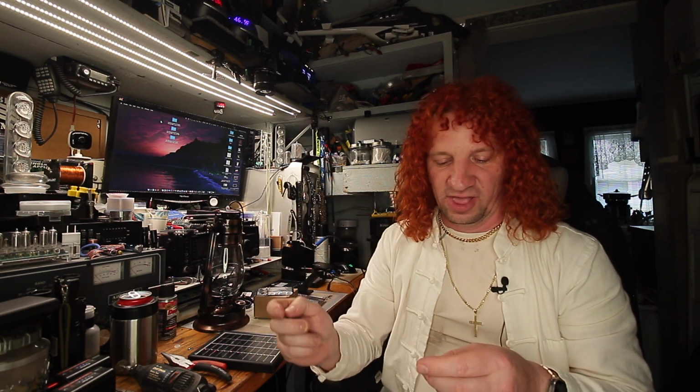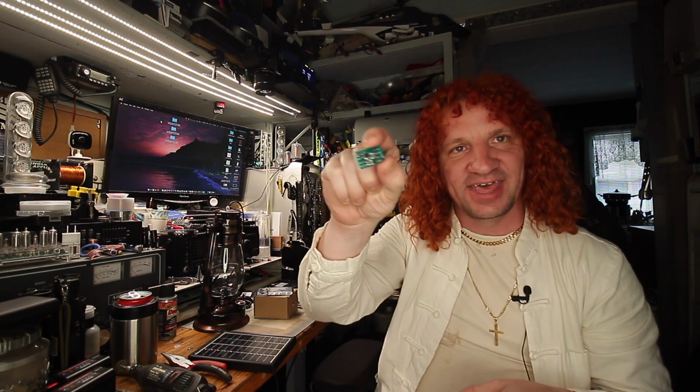And then the load part of this panel will go into the battery of this controller. And then I'll wire up the solar connections in parallel. So one set of wires will go to the charge board, and the other set will go to the LED board here to trick it. So it does all the work of monitoring when it's too dark out to turn the lights on, or when it's starting to get light, it turns the lights off.